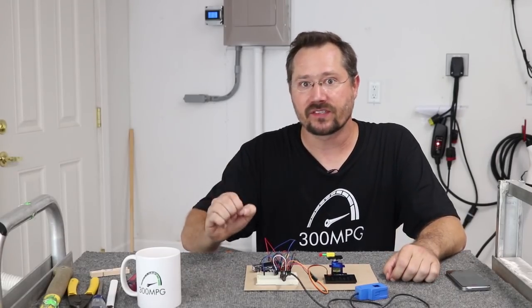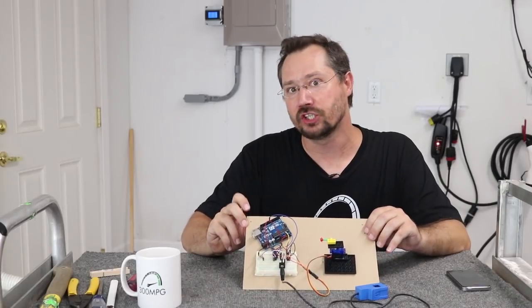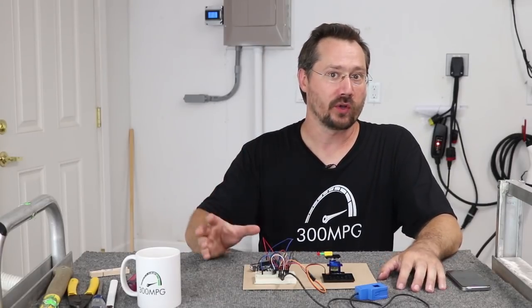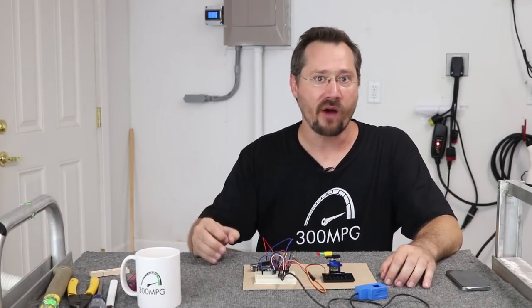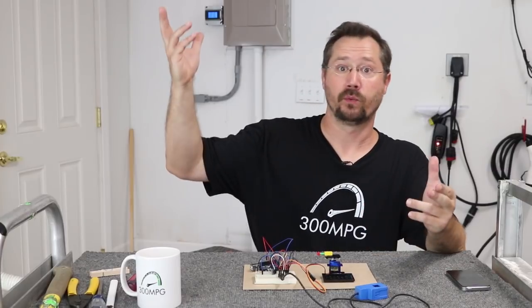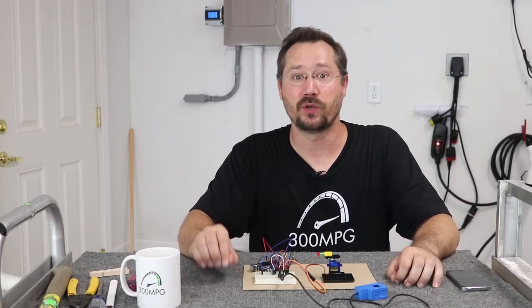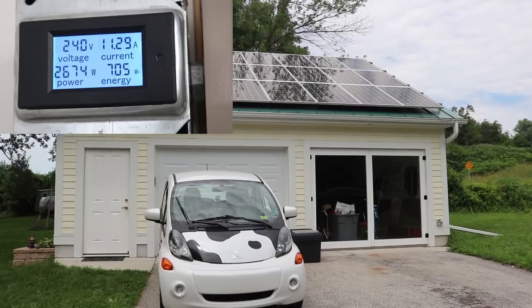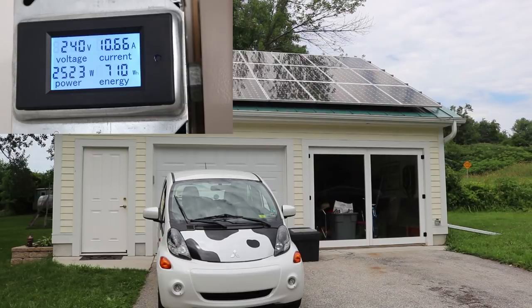So let's say I wanted to charge my electric car only when it's sunny out — I could plug in an EVSE to a box controlled by the Arduino, and when it was sunny it would turn the EVSE on and start charging the car. Even better: in an EVSE there's a control signal that controls how fast the car can charge. Using an Arduino I could actually generate that signal and instead of just on/off, control the current the EVSE allows the car to pull. Like right now with clouds, instead of turning off the EVSE we could drop it to 10 amps or 6 amps, and when the sun came back out go all the way back up to the full 16 amps. Subscribe so you don't miss when I work on those projects in future videos, and until next time — stay charged up!